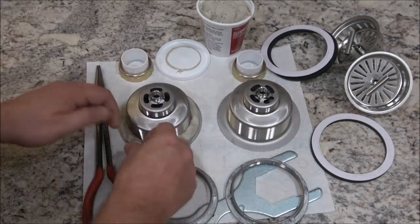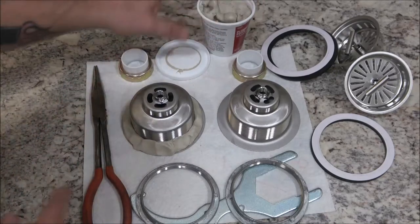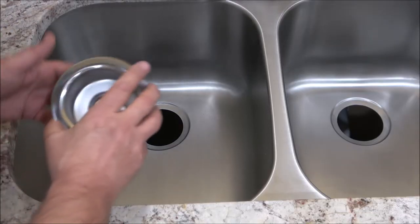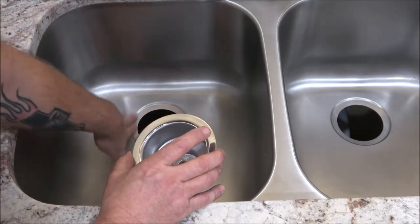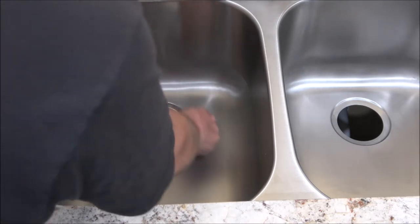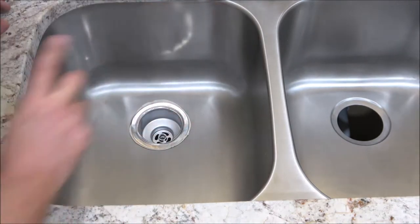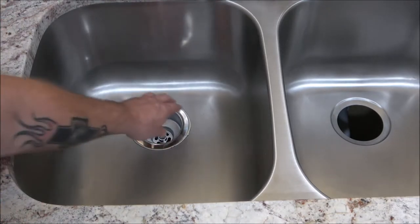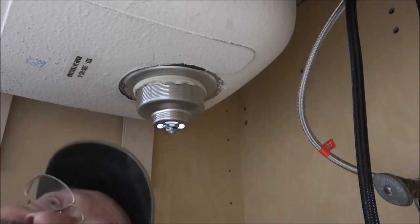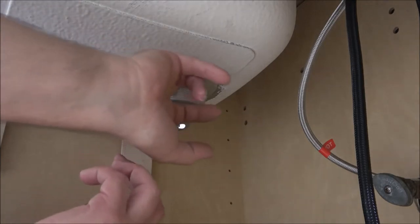You can put another piece on there if needed. Remember, I'm not a plumber — I'm a mechanic. Now I'm going to show you how to put this one in. As you can see we're at the sink. Just make sure it's clean if you're using an old sink, then stick the basket down in and push on it. You should see a healthy amount of putty squeezing out around there. Now we're going to go down underneath the sink — I'll try to film that for you the best I can.